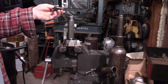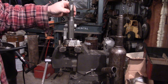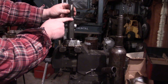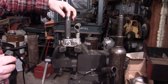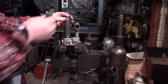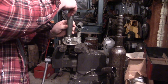I found something interesting — I was looking through some pipe taps I had and I notice I do have a pipe tap that looks like it will fit right in there. I'm thinking I might try to pipe tap this. I also notice there's a little hole right here by this thread that I believe is used as a relief of some sort to allow air and oil to get in there. I don't think there'll be any problems. Once I thread it in there, it should be fine — it looks like it has plenty of remaining metal once I tap it to still be strong.